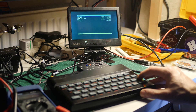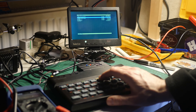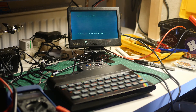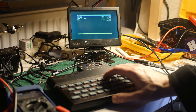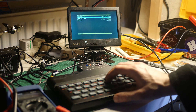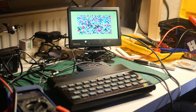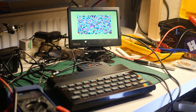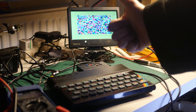I'm going to have a quick look at a demo, but unfortunately there was a problem. Some of the larger demos wouldn't actually run, and for a while I wondered why. It turns out that part of the memory in this Spectrum is broken. Demos that required quite a bit of memory — pretty much all of the 48k — didn't actually work. But the more compressed demos seemed to work fine. So it looks like we're going to have to replace some of the memory chips inside the Spectrum.